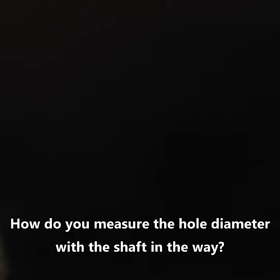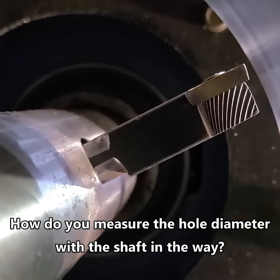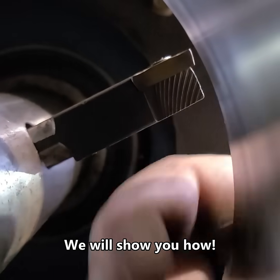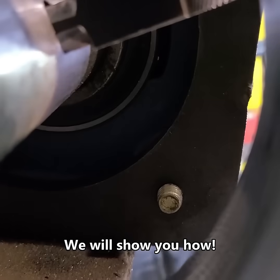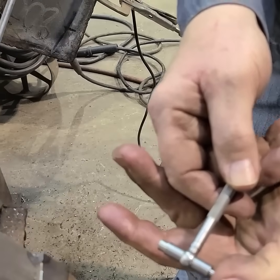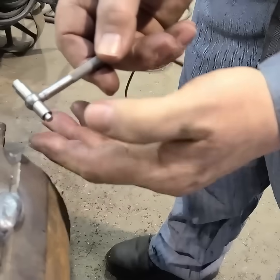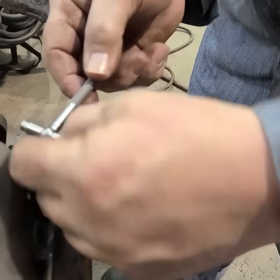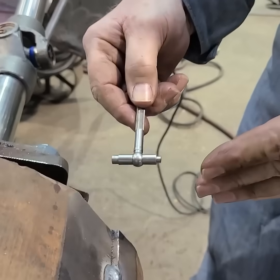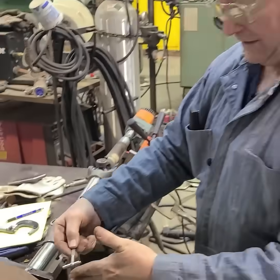Telescoping gauge — what we want. So when we go in here, I'm going to be letting this end of the telescoping gauge swing in the bore as it comes closer and closer to being inline with the center of where we are on the diameter.